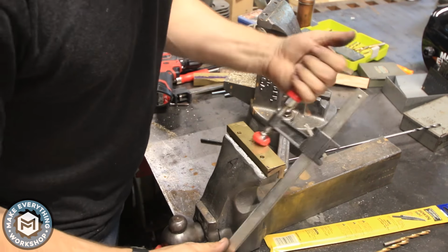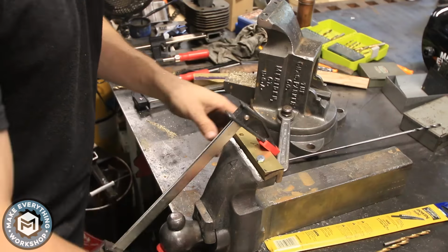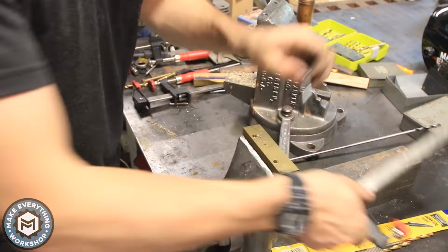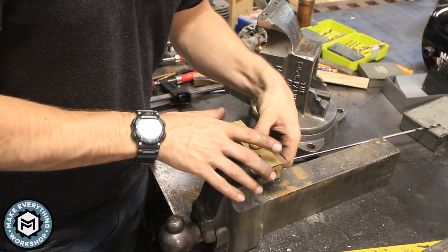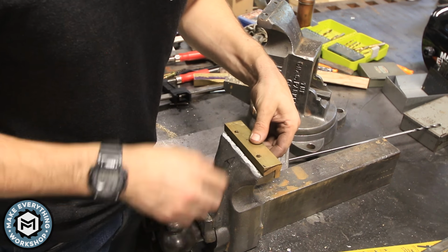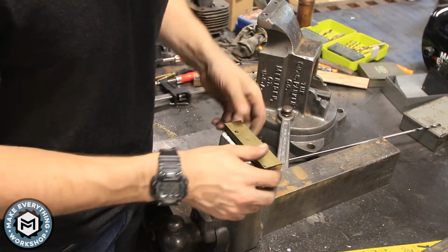So again, I made my little error, and I was able to use the soft jaws as a drilling guide to drill down from the top and open up those holes a little bit. Thankfully that worked. Okay, we're good. I can't believe it. Salvage the A jaw. Now I'm going to go back and actually do the correct jaw for the B side.